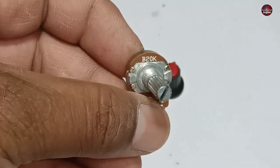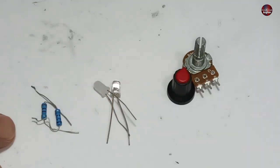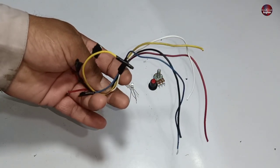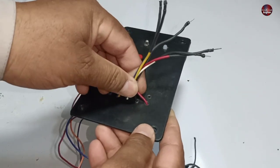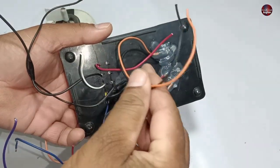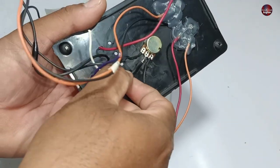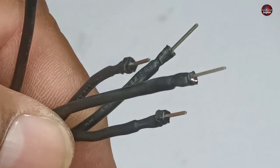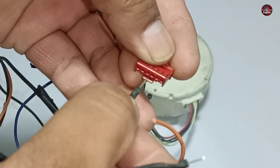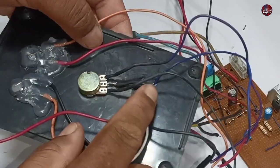In the end, we need a 20 kilo ohms potentiometer and a knob to place above it, then 2 LED lights. It would be best to use different colors of LED and a couple of 1000 ohms resistors. Other than this, we need some wires of different colors. Now I have installed the potentiometer and the LED lights on this plastic box cover. The LED lights have 2 wires, and the potentiometer has 3 wires. The yellow wire is the common wire or the output of the potentiometer. Now I have soldered pins with the wires for connecting the wires with the motor's connector. This way, we can easily connect the motor to the control circuit, even if we get any motor with a different connector. First, I will connect the potentiometer side pin wires.